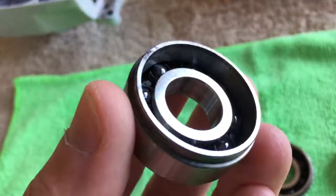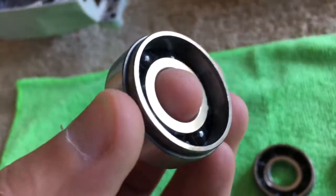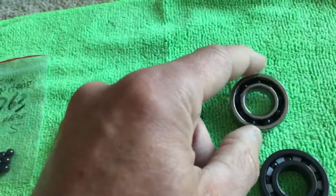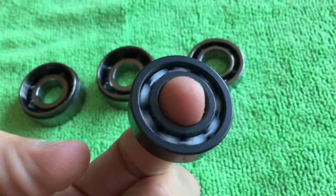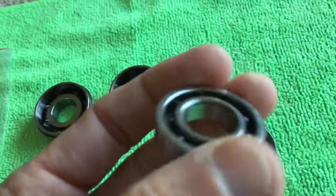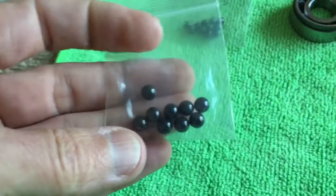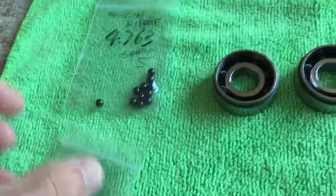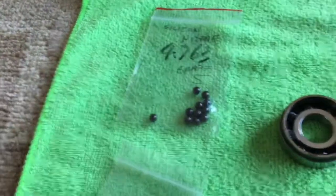The reason I did this was to reduce friction and maybe get a little more horsepower out of the saw. On this side — where the oil pump is — there's a milled little lip that engages with the oil pump, so you can't really find a full ceramic bearing for this side. This is the flywheel side. I did locate a full ceramic bearing on eBay, but I don't think I'm going to press it onto the crankshaft — I feel better with the metal races with ceramic ball bearings inside.